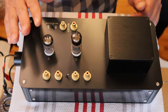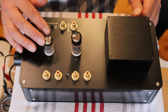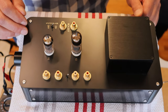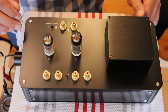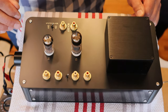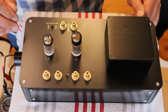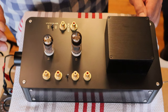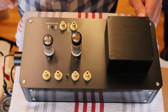So what would be the tubes in the ballpark that people would know? The 6DJ8? Yeah, so it's very similar to a 6DJ8 or a 6BZ7, although I would consider it to be better than that. But anything in that sort of high, medium amplification factor and general purpose. So a little bit more gain than a common 6SN7 or 12AU7. Yeah, at least 50% more, depending on how you've got the amp set up.